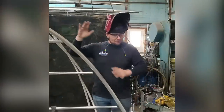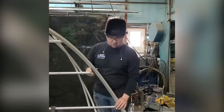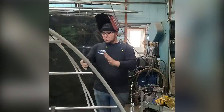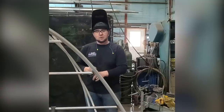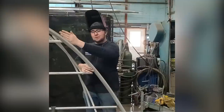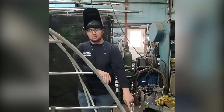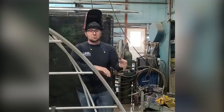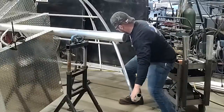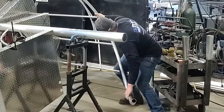So now that we have two tacks up top and the railing sitting nice, we run into a little bit of a dilemma. These two posts sit really nice. These two posts have about an inch gap in between, and this bottom post sits in there really nice. So most would tend to just pull this down for these two posts to meet. But if you do that, you're going to create a hump in here where it's going to come up from here, dip down to these two posts and then hump back up where that other post goes. So instead, we're going to take this pipe and twist it so that that end goes out and it brings this end in. So it just lays right in nice with these posts rather than just pulling it straight down and creating a hump.